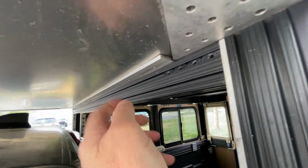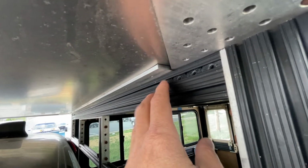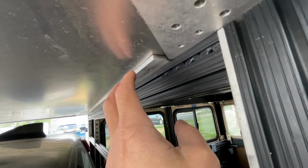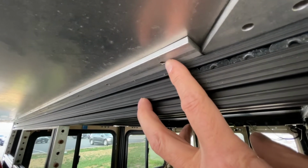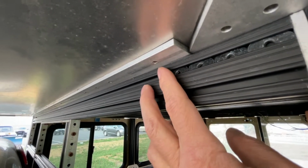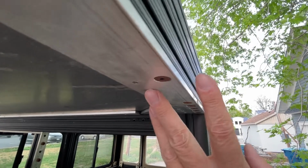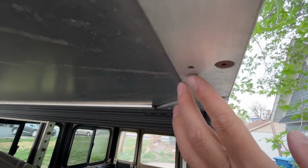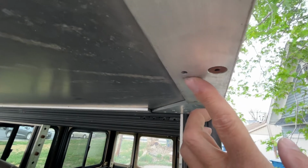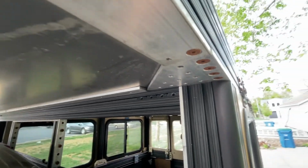And this is because this is a piece of sheet metal with a 1/2-inch piece of plywood above it. It was supposed to mount directly into this rail, but it was impossible to fish out the T-nuts that were on the top slot here. So what I did was I drilled some holes and tapped them to 1/4 inch. And so the plywood is bolted directly to the flat bar. This kind of matches how I did the rest of the perimeter on the overcab, where I drill a hole and then attach it directly to the rail here. And on the inside is a tapped hole where I can just bolt the plywood on the overcab directly to the flat bar here. And when I go over the overcab in detail, you'll see all that.